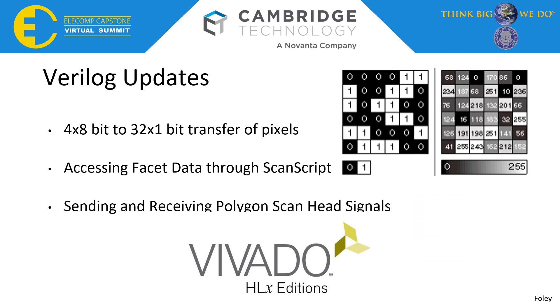One of the initial steps was to update the Verilog logic inside the board. Originally, Cambridge Technology sent a 32-bit string containing four 8-bit pixels. We updated this to be a 32-bit string of 32 1-bit pixels, meaning our image was completely in black and white, which was fine because the Polygon ScanHead renders images so quickly that pixel color doesn't matter. We then updated what data was sent through the logic into the ScanScript language. Certain registers were used to access data about the Polygon ScanHead or the facets inside, so we had to update what was sent through and how. The Polygon ScanHead outputs information about itself — such as what facet it's on and what speed it's traveling — through the I/O board into the logic, which handles these values and sends them into the upper-level logic.